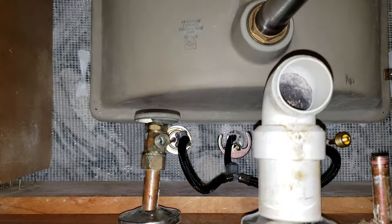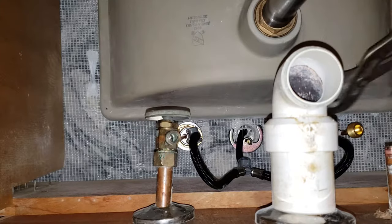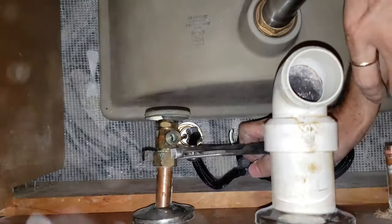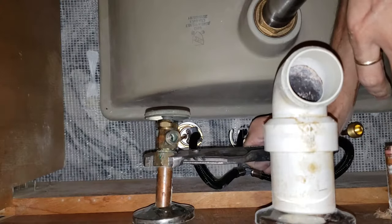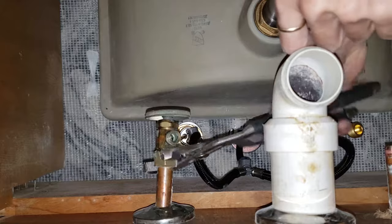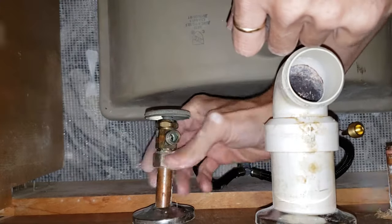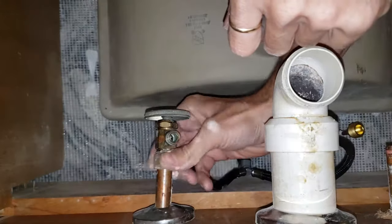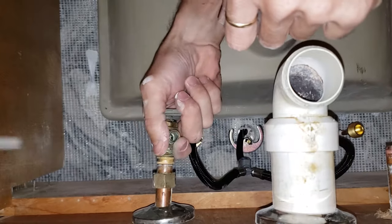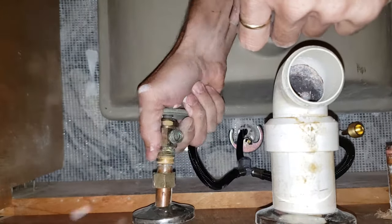All right, I've got a bunch of these to do today, so I'm going to go ahead and show you how to do this. Now, I know that these compression fittings like to stick, so I'll pull off one of these. First thing to do is to break this loose — when I say break, I just mean break that stuck seal — so once you get that nut off, this will usually just kind of pop off. Wiggle it a little bit. Of course, hope you have the water turned off first.